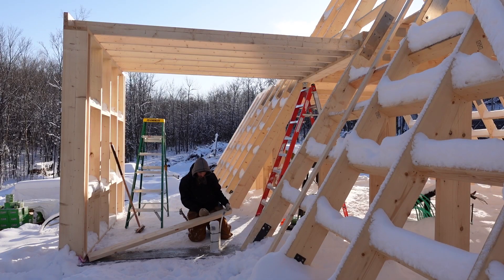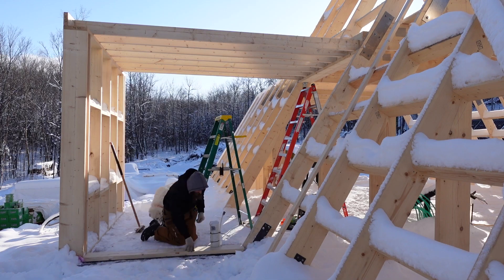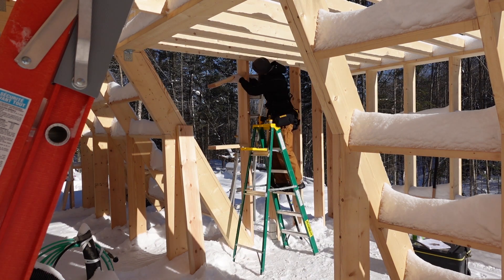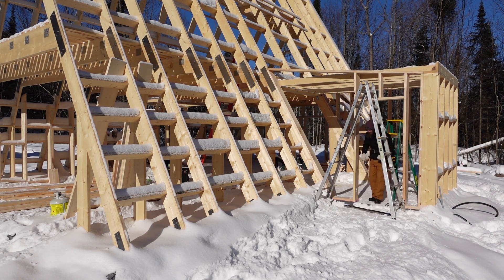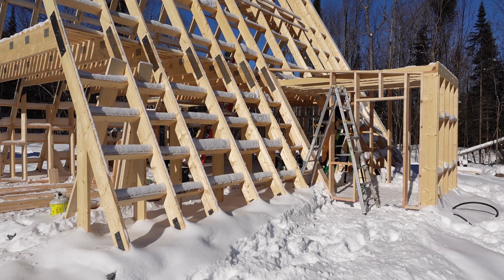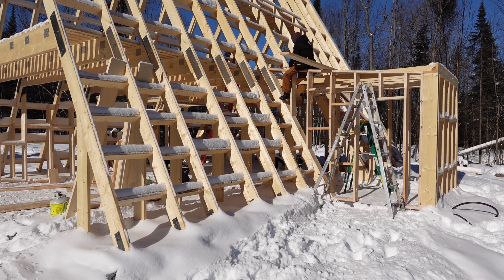After the ceiling was installed I moved on to the two side walls of the dormer. On one side we have a plumbing stack where we'll likely put the laundry machine, so I had to cut notches in the bottom plate of that wall. Because of the shape — the bottom portion is only about 6 feet but the top is around 12 feet long — I knew it would be almost impossible to stand up by myself. So I framed it all in place; I believe it's called balloon framing, where you build it standing up rather than lying down. Once both side walls were done I finished up the roof parts of the dormer, and before I knew it both dormers were fully assembled.